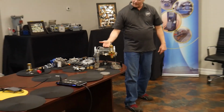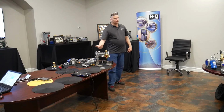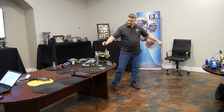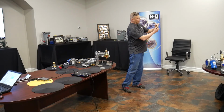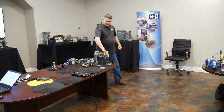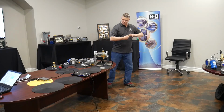Now I have, because there's gas that's dumping basically out this way and out the valve, that can't be reloaded by the restrictor, I have less pressure holding the diaphragm down than is coming through here. So it's going to push its way through. Okay? And when my sense pressure is reached, that I set this spring in here to basically keep the valve open until there's enough gas to work against it. Once that happens, this little plug and stem assembly gets to pop back up, reseat the little valve in there, the little plug on an orifice, blocking that pathway out the outlet. And the only thing that's going to happen is that gas reloading is going to win and the valve shuts down, because I got 200 pounds back here. All right, so let me show you what that looks like real fast.